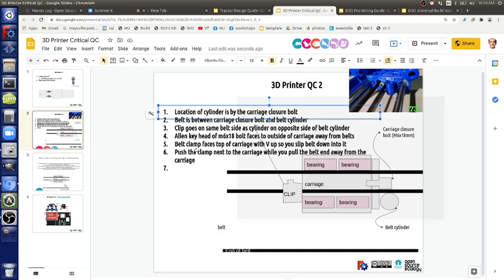You need to make sure that all of your set screws holding your rods are tight before you do all this, because if you start tightening and you haven't done that, you're gonna crank down your rods. So before doing all of this, fix your axis length. That could be by set screws, could be by mounting plus set screw on one side. It could be by the Z, by putting the cap on, the spool holder on top, and that locks the length of it, because the other end bottoms out in the base piece. So I'm gonna say before doing all this, fix the length of axis.